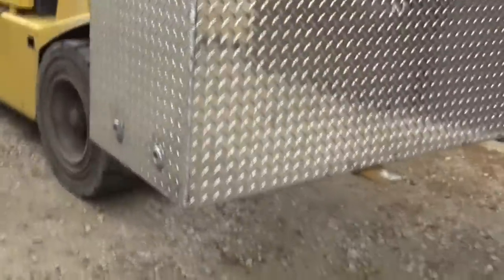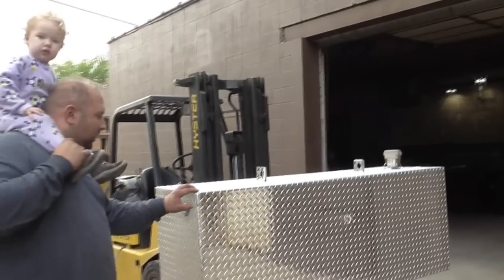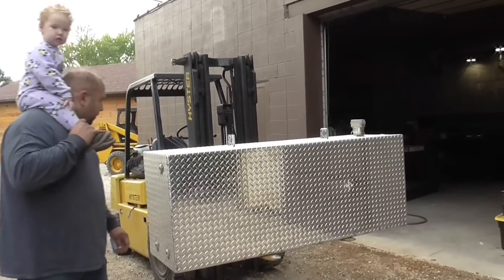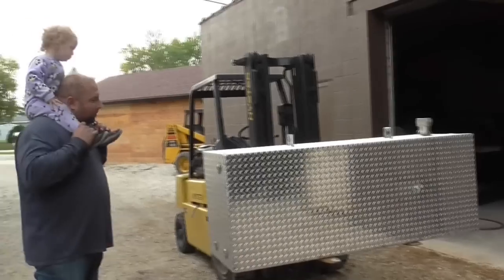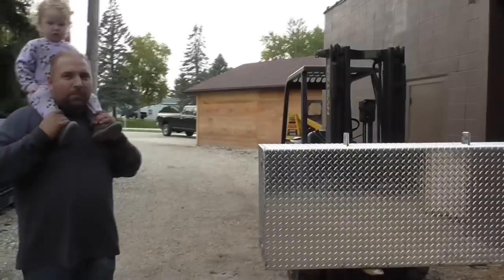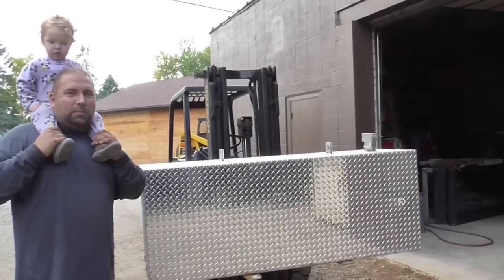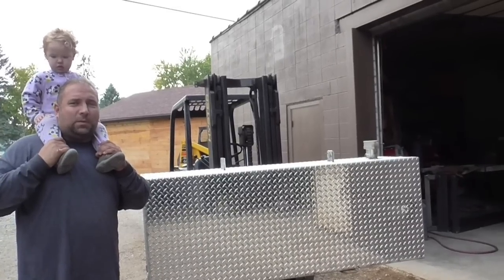There's a few pinholes down in there. Nice job on the brake press and the cut, nice fit up, but unfortunately everything is wire welded without pulse and with the cold starts and stops, probably no preheat — that's where some cold fusion and some pinholes came in. So my little helper and myself, we're going to check it out now.